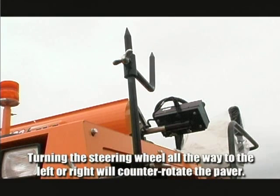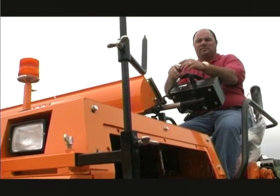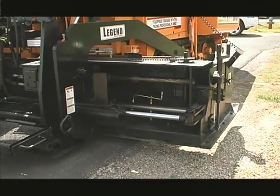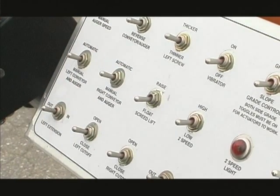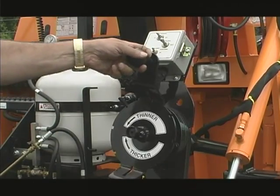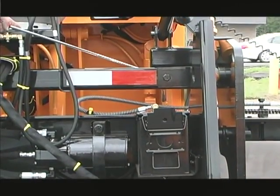A guide bar, located on the front end of the hood on either side of the paver, is used like a rifle sight to see accurately where asphalt is to be applied. Have a second person adjust the guide while the operator sights its position. To set the screed for paving, move to your starting position and set the screed to the desired width. Set the screed toggle switch to the float position, which will remove the hydraulic pressure from the cylinders. Turn the flight screw approximately one complete turn clockwise. To obtain the desired crown or valley, loosen the hex nut and the two bolts on the slope supports on the right side of the screed.